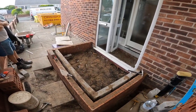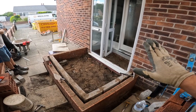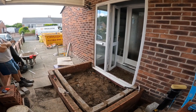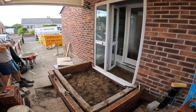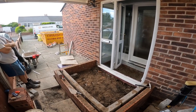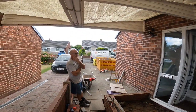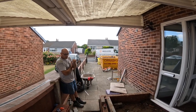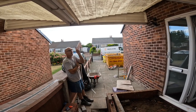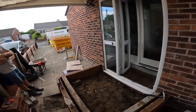So that's us for today, though. Well, us for today and tomorrow. So we're going to be back here Monday to get this slabbed up, concreting is slabbed up, isn't it? Slabbed up, tamped up, and we'll start the brickwork then. Yeah, in the afternoon. Get the profiles on and back the brickwork. Dad's going to load out some brick while I do some tidying up, but then Tuesday, if everything works well, slab will be in, brickwork will be almost done. So Tuesday, we'll do the block work inside in the morning, and then in the afternoon, take that down. But for now, we'll see you on Monday.